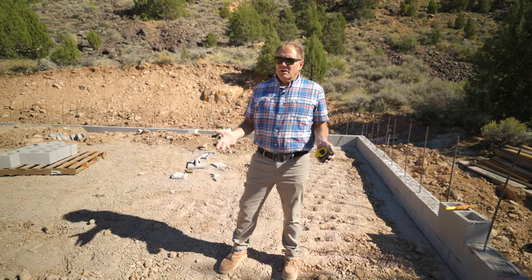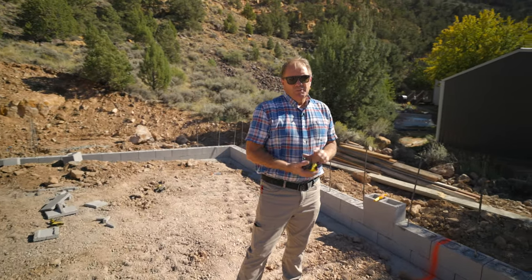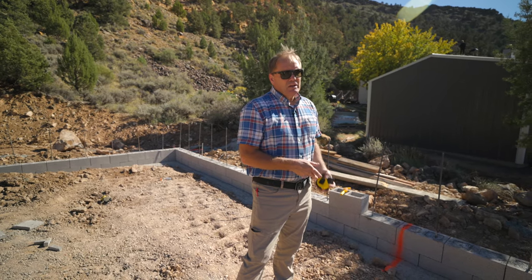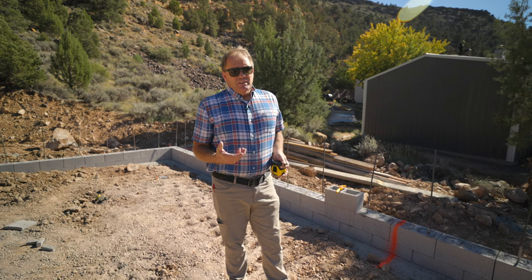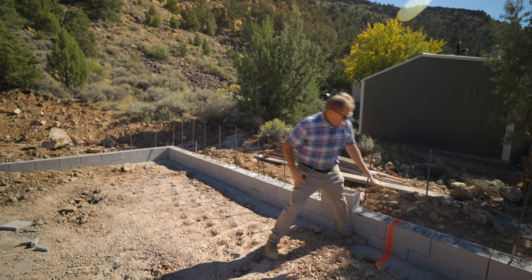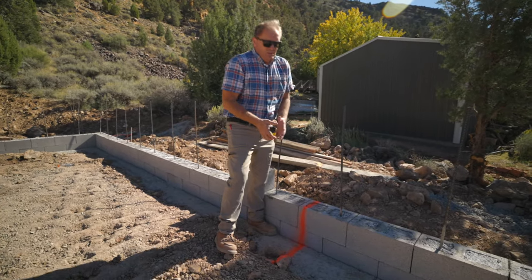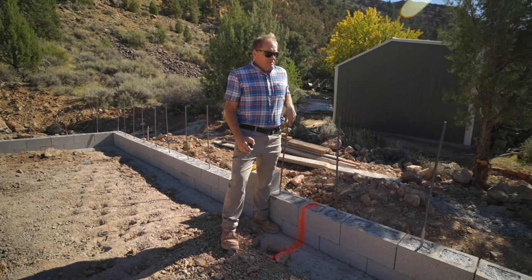When you deal with a lot of frost depth, this here is an option for you. I'll do some video when we do the final slab on this home where we'll have a turndown and make connection to the stem wall — we'll actually have a nice clean look. It'll be stained concrete, but we're actually going to save a lot of concrete. That's the key: to keep your frost depth limited to just this 8-inch block. I didn't need a huge slab over here wasting a lot of money with concrete. We're going to really limit our costs on concrete.